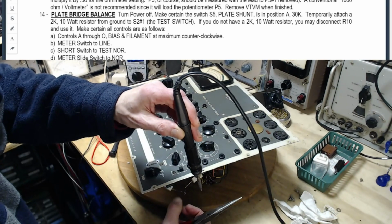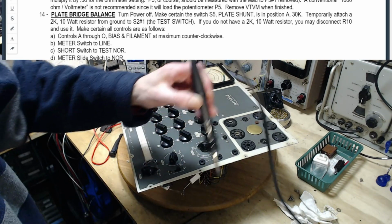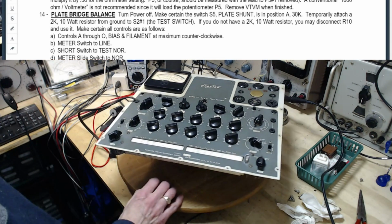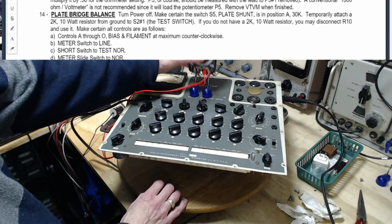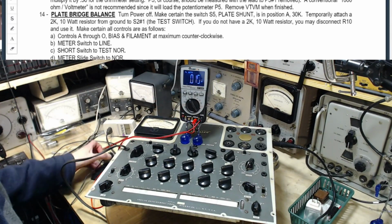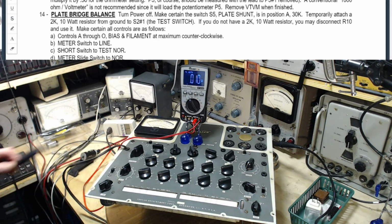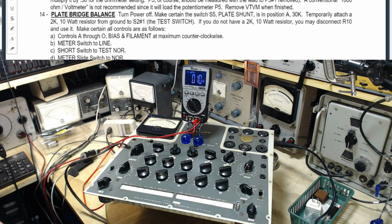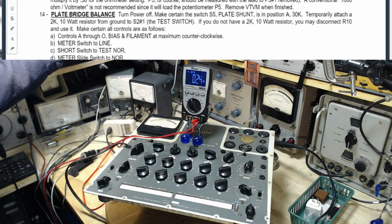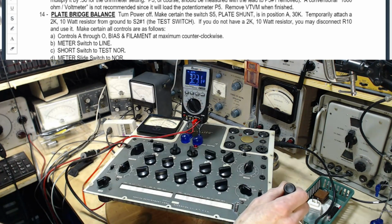Okay, well, still soldered the ends. Okay, that guy's out of the way. Mr. 5-volt meter is back on here. And I'm ready to do the adjustment. It's this one here, 5. Okay, power on. Power's on. Resistors disconnected.